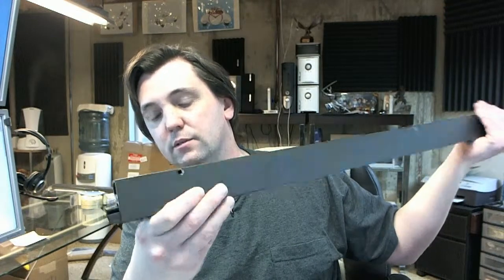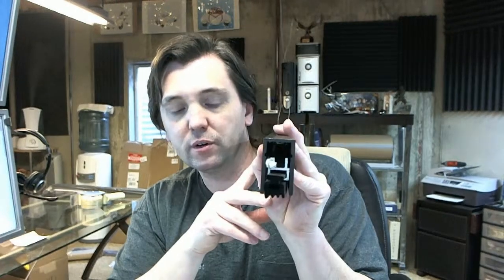These are great items. I think Dorbin has been making these forever, literally forever. They go about solving the problem of achieving a very nice seal without your bottom dragging across the floor — that's the major advantage of an automatic door bottom. You can also semi-mortise this. There would be no reason you couldn't mortise the face of the door completely for this channel. You'd have to consult your door construction, but if your door allows it, there's nothing in the material itself that would disallow it.